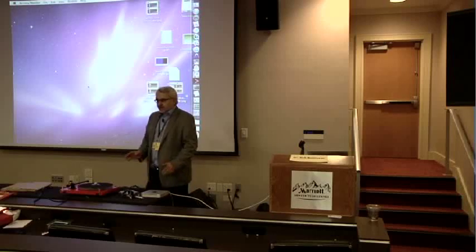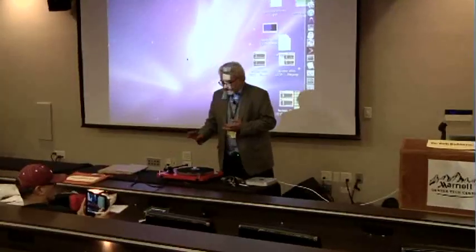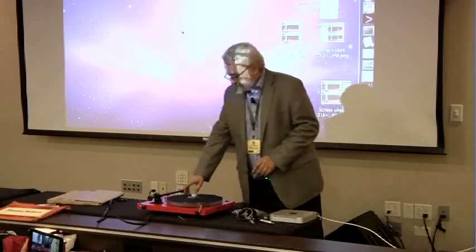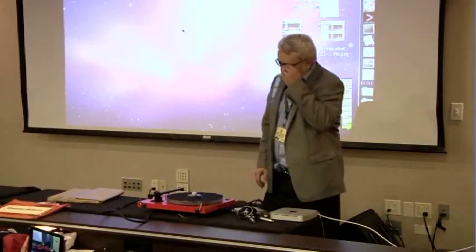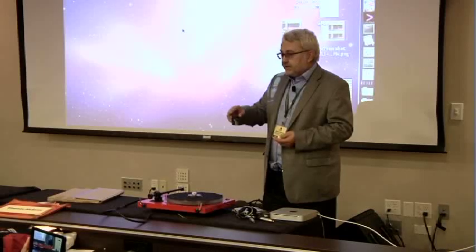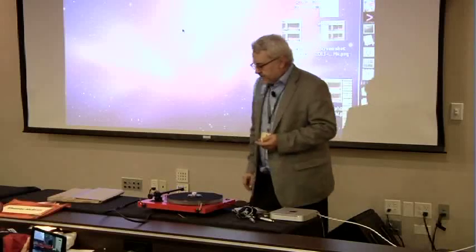I'm going to demonstrate this with some of this equipment here. I deliberately chose a budget price turntable just to show you the type of information it's possible to transfer from LP, even with a modestly priced turntable here. And I should shout out thanks to Roy and Leland from Music Hall for loaning this turntable. It's a Music Hall RMAF15, and I've changed the cartridge on it to a moving coil cartridge, because a moving coil cartridge does have a more extended high frequency response, and I'll use that in my presentation here as part of the demo. Just one thing, if you do that with this turntable, you have to replace the stamped steel platter with the acrylic one, or else you'll crash the cartridge, because the magnet in the moving coil cartridge will just get attracted like a vacuum cleaner, and there's your cartridge.